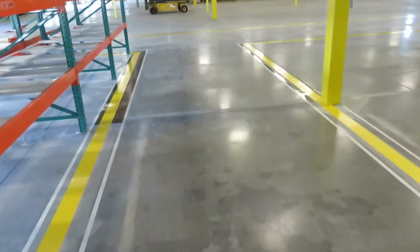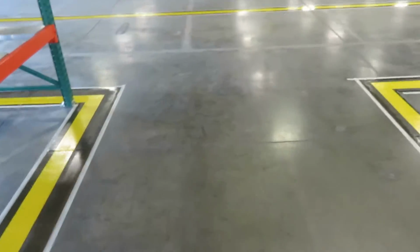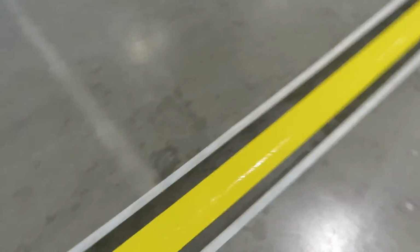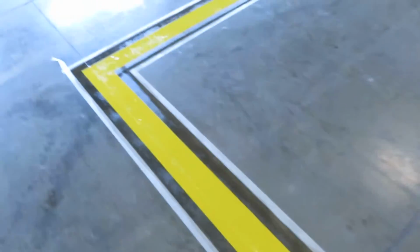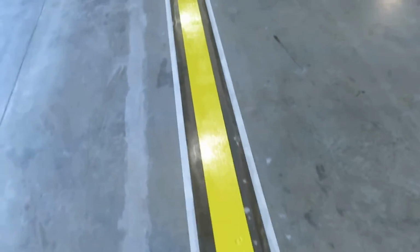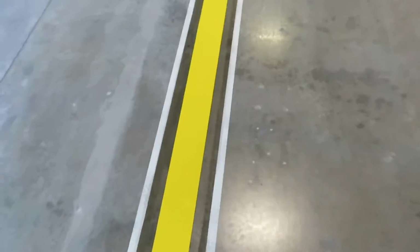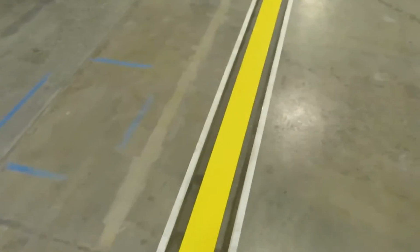Thanks for watching this short little video of another one of our Central Florida, actually Lakeland here, warehouse floor striping projects. Nice shiny durable lines. It'll look a little non-uniform for a little bit till the sealer actually dries. Everything will still stay real nice and glossy. Obviously where the shaved marks are, it's going to look a little duller because it's going to adhere into the concrete itself. And then it's going to be on top of the yellow 2-part solvent product that we have.